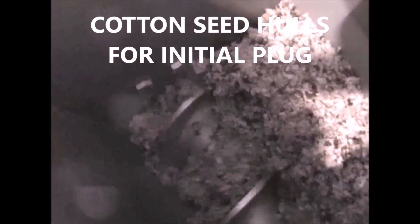And that's being fed in, feeding fairly well. The crumb rubber — I put on about 3 gallons of water, 24 pounds. Closed in that cone quite a bit; that arm was inclined upward, now it's down. The material I'm going to drop in the press is this crumb rubber. If I take a handful and squeeze it, you can see the water coming out — clear water — and that's what it looks like. Let's try and give it a couple bags of stuff. No water has come out here yet, and there goes the second bag.